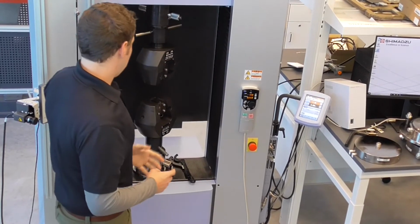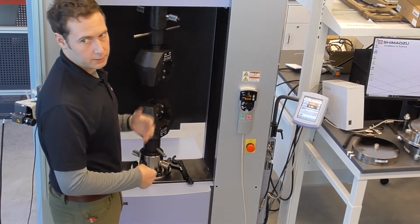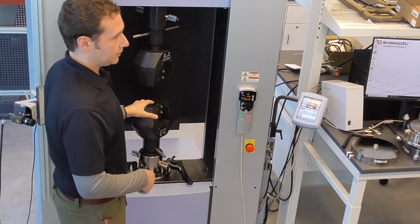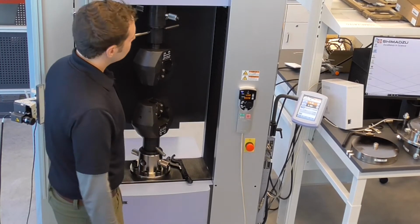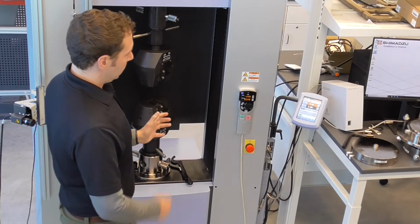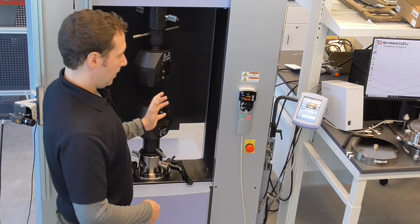Whenever you do a restart of the frame, whenever you turn the frame off and turn it back on, you need to rewrite this data. Essentially, in the frame, it's volatile data, meaning when you turn it off and on, it gets erased. So you need to copy it back. Something that's very important to consider with this cal cable is that you cannot disconnect it or reconnect it when the frame is powered on.